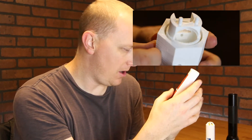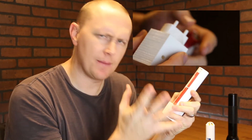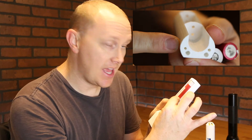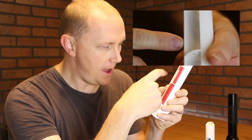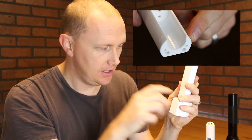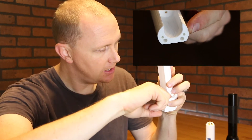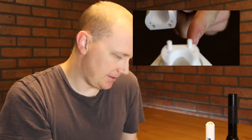I've widened that because those Walmart 18650s have the button on them actually risen up — I might have to revise this. But positive, positive, negative, negative. There's going to be a wrap of wire in there going down another tube to the negative end on the chip, and also through the hole and around this so it'll contact the casing. Just like the single cell, I've got the positive going up, positive out here.